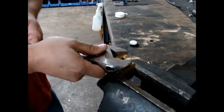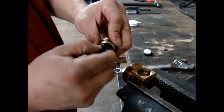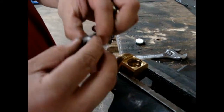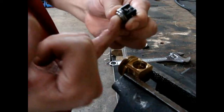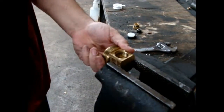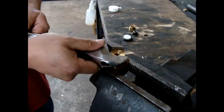Inside here will be your disc and diaphragm, and the new disc. Check valves — make sure they have the O-ring. Make sure there's no rubber stuck in between where it sits. Clean that out the best you can.